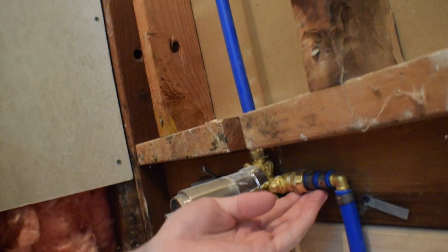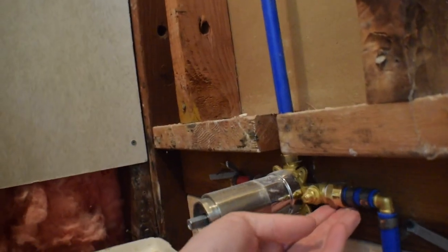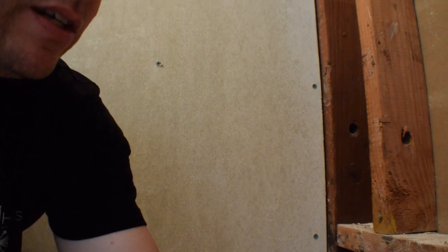It's not a real scientific method, but usually I just check — anytime you see a puddle on the ground, go all the way up, and the highest point you find that's wet, that's where your leak is coming from. I checked on this side; it wasn't that elbow. I don't know if you can see on my hand, but that's wet right there. I guess this is where I threaded this on — I just didn't get enough Teflon tape on there and it's got a leak. So I'm just going to cut this loose, cut that off, and redo that real quick.